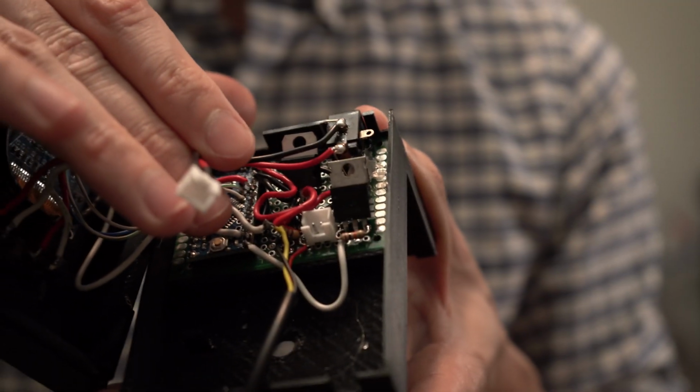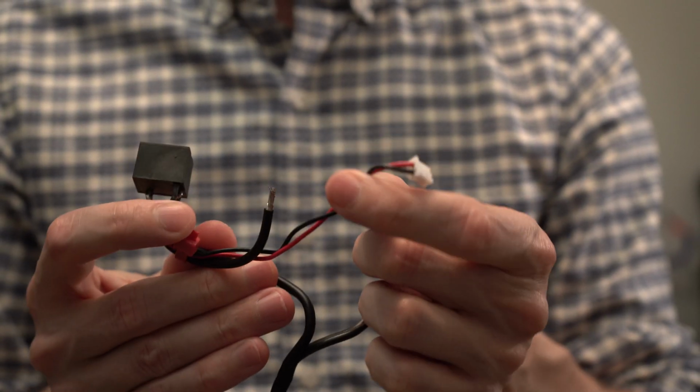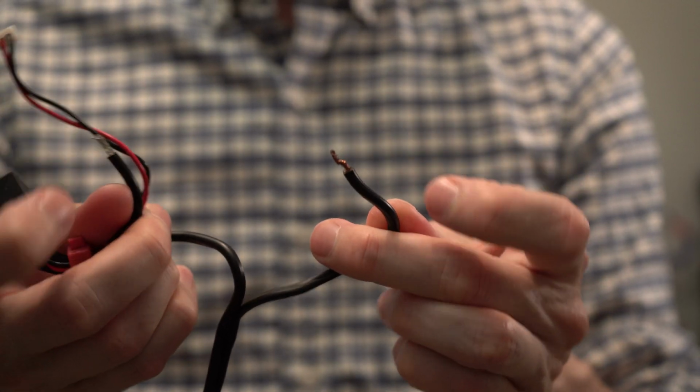Inside, so we got the screen, and then the wiring for the buttons, and Arduino. This drives the DC motor, and a little plug for the relay. So the Arduino just sends a little signal through this cable to tell the heating element when to switch on, which is controlled by these wires. So it was a little involved, and there were a couple of things that I had to buy, but I'm still pretty proud of how it turned out, and it works.